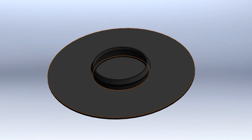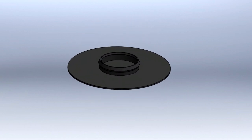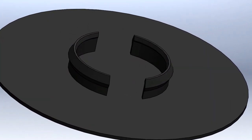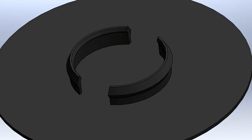I measured the outside diameter of the original cap and basically just mimicked it for this one. For now I'm just going to go with a flat face — nothing crazy — I just want to make sure they fit first. So afterwards we do the cut. For some reason I couldn't get the wrap feature to work, so this cut is not perpendicular to the tangent of the curvature. It's just a straight through, but that's okay — it doesn't really affect the performance.